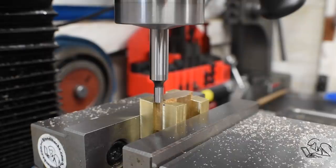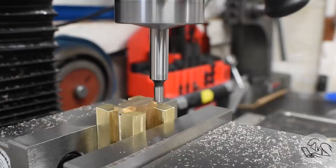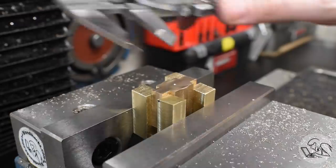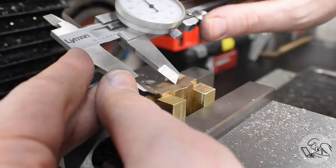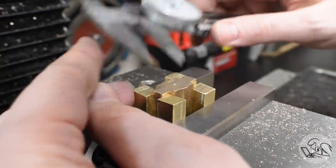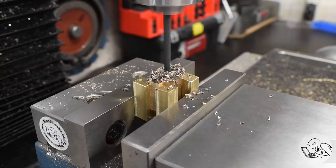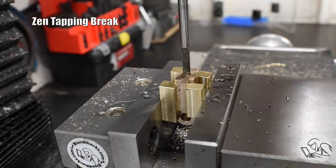I'm ready to drill and tap the hole where the piston rod goes in. This needs to be centered really, really well on the overall part, so I'm edge-finding on the outsides of the machined rails and on the top and bottom of one of the rails, so it's centered on the rails regardless of where the casting happens to land. Because the location of this hole is so important I'm doing everything I can to double-check it - calipers, scales, sanity-checking every way I can think of. But at some point you've got to stop double-checking and fretting, and there's nothing to it but to do it.